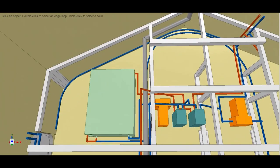Our hot water system is unique in that the water flows through a closed-loop system. It consists of a hot water tank, two heat exchangers, and a third pump. This is so we can heat two unconnected systems without cross-contamination. The water is heated inside the hot water tank by two heating elements. It is then pulled through the two heat exchangers and pumped back to the hot water tank.